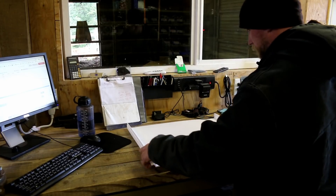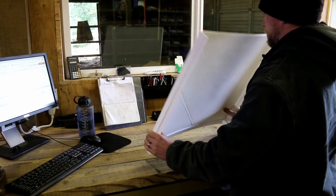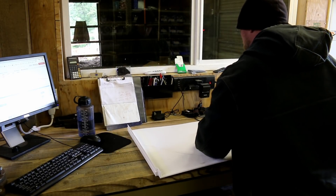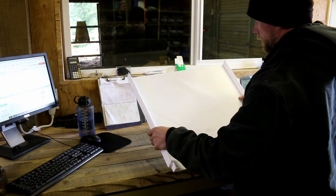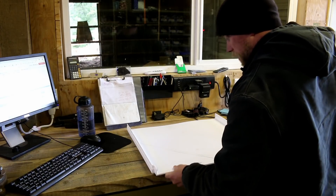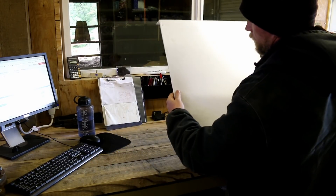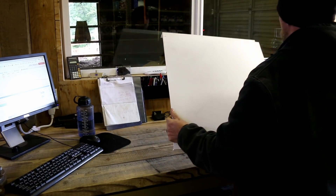It's bowing now that it's off and cooling down — I should probably let it cool on the bed. We do have second layer separation — that is a leveling issue. We've got a bubble showing up in there, so that second layer is popping off of the first. I think we have a leveling and extrusion height combined problem, and that might explain why it's so flimsy — the layers are not bonded to each other.